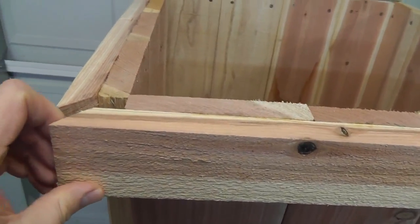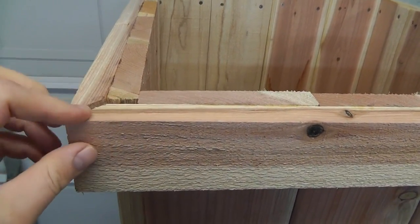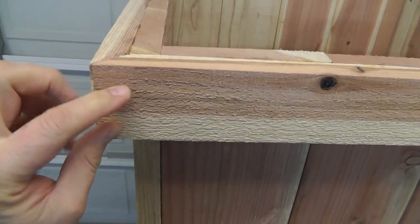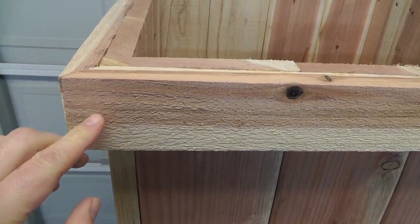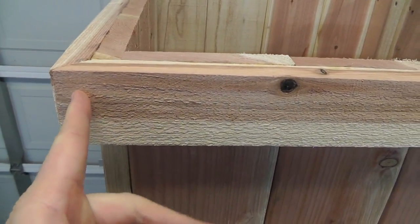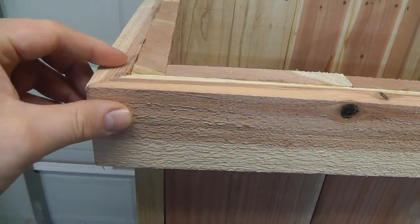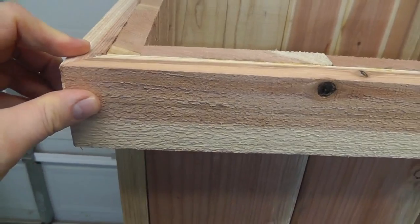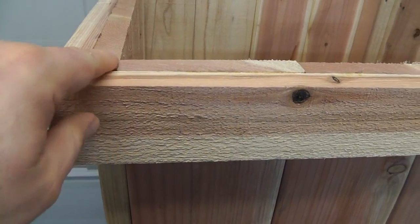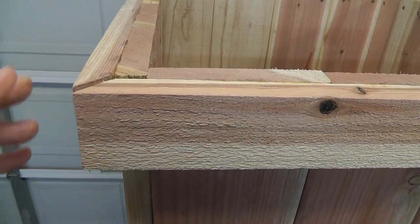And the reason being is you want the side next to it to come all the way in so that your 45s line up. See, just like this. This wall here comes in, and then my 45 lines up here. Now, one beauty of doing it this way too is that I'm not going to have to screw into this bevel here and try to get that to stay secure. It's a weak link is what it is. Here I'll be able to screw directly in here and hit the edge of this 1x, and it'll be a lot stronger, and it'll help square it up too.